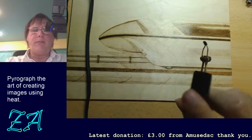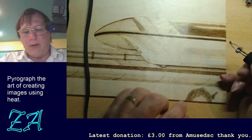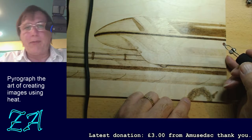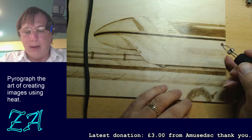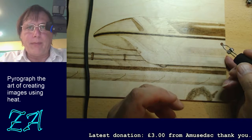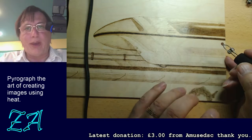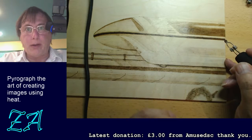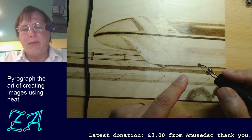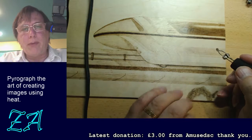And then essentially, when you apply heat to any organic substance, it's debatable exactly what it's doing, but effectively it's cooking it. Just like you might cook some meat in a pan, it's doing a very similar thing. It's cooking the wood fibers, it's drawing out some of the sap, heating that up, which then sits on the surface. That's some of the brown color. Some is coming just from the fibers themselves, which change color when a lot of heat is applied. So this is running at something like, I'll take a guess, 150 to 250 degrees Celsius, which is enough to cause the wood to start to change color.